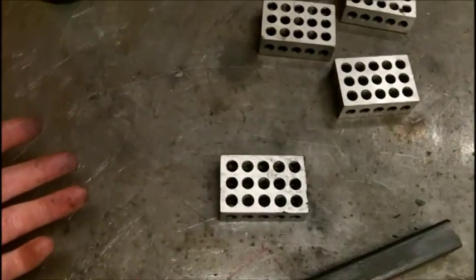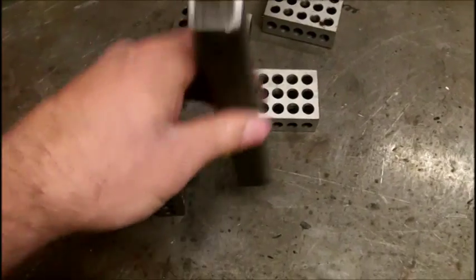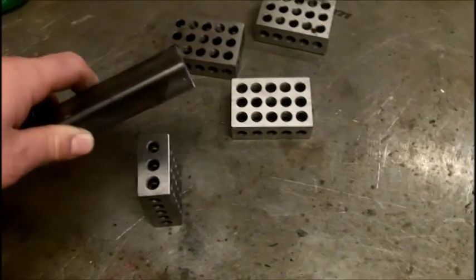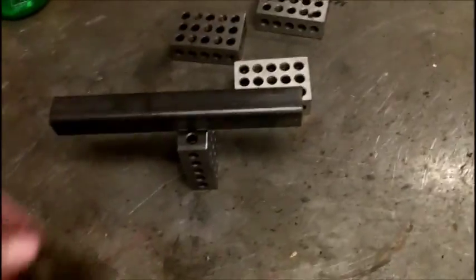They're all machined flat. What I'm doing is basically clamping them underneath a joint — so if this is a piece of pipe going up to a vertical piece, I'll clamp the block underneath the first weld as a big heat sink. At that point the piece has already been checked for level in both directions and for the correct measurement. This is the first time I tried it today and it seemed to help. I always try to tack on the corners versus the center, because that also keeps the fitment a little tighter.